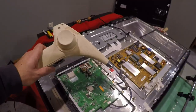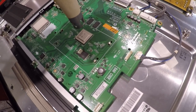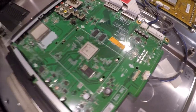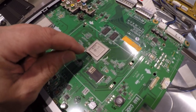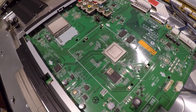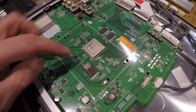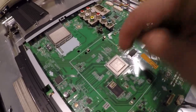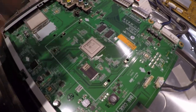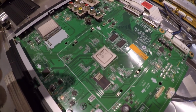So what I did to fix it was — I have an electronics heat gun here, it gets pretty hot. Basically I heated this chip up for around six to eight minutes. If you get it hot enough you can actually remove the chip, but that's not something you want to do because you'd have to re-ball the chip and re-solder it back on, which is an advanced technique. You could send your board to a board repair house and they could re-flow the chip. But all I did was heat it up and put a little straight-down pressure on it with the tip of my pliers. I didn't want to move it, just heated it up pretty good. Hopefully if there was a cracked solder joint, it re-flowed and reconnected itself.